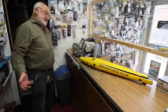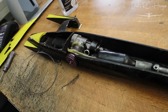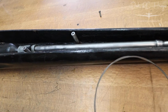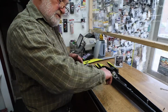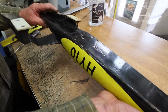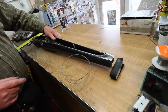Well, the thing is that my latest versions are taking this the next stage on. I can show you now. Yeah, let's see those. All right, Alan, so what are we looking at here? Right. This is a West 36, which in the tethered hydroplane class holds the record. Not by me, because a lot of it is down to propellers, and I'm struggling to make propellers. But again, it's got the same format, lay down motor. Normally the motors are standing upright, exhaust down the side, 2 sponsons out on piano wire. So I don't like that idea. So again, it's got 2 sponsons, but instead of being on a piece of wire, it's on an aerofoil section. Oh wow, clever. Again, with the exhaust pointing up. To push you down.